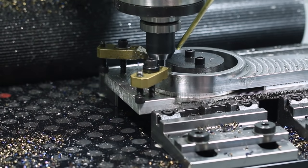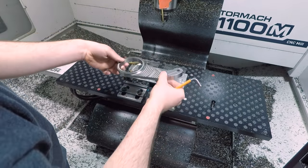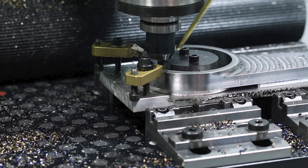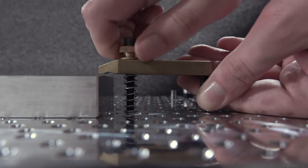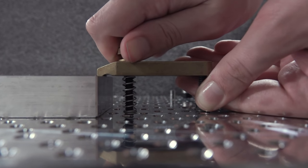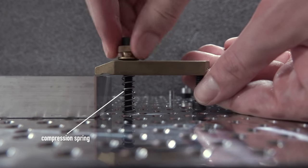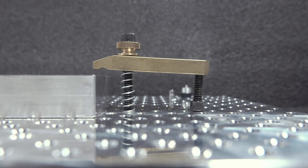Having clamps like these — commonly called strap clamps or toe clamps — is an invaluable resource for any machinist. For anyone new to machining, this style is very common. There are three key differences with these brass ones: Number one, they're brass, so they're less likely to mar your part. Number two, the back end of the clamp is tapped for a fastener, allowing you to quickly adjust the height, keeping the screw captive so you don't need pesky step blocks. Pro tip: put a compression spring underneath the clamp screw. That holds the clamp up so when you loosen it, the clamp stays out of the way and you can easily remove your current part and load the next one in.